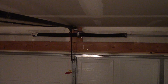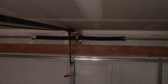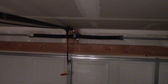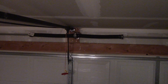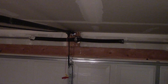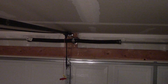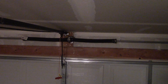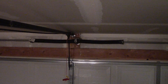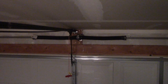What you're looking at are the torsion springs of a garage door opener, and that's what they should look like. Over time, sometimes they break, snap, or come unraveled, so you want to make sure they look correct. A garage door that doesn't open all the way, or kind of slows down and stops — you want to look at that. Cost-wise, you're looking at a couple hundred dollars to replace it, plus labor on top of that. That's one of the ways a garage door can fail.